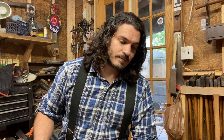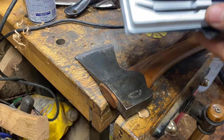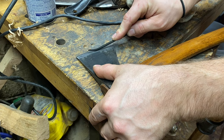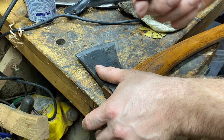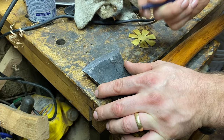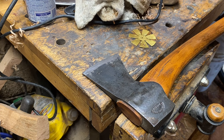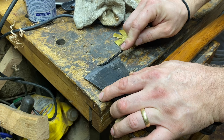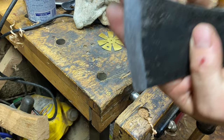I'm going to take our same hardness files and start at 60. Wow — 60 doesn't cut. That's incredible. Here is 65 — and 65 cuts. You can see the 65 cuts here; you see these lines? Those are the 65.